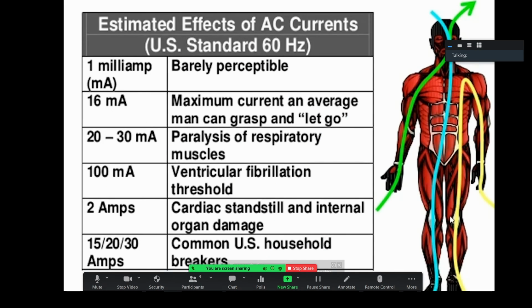But one thing that a lot of technicians say, it's kind of silly, is they'll say that it's not the voltage that kills you, it's the amperage. And while there is definitely truth to that, when we're talking about working on high voltage electrical systems that are connected all the way back to the main distribution panel, back to the transformer out at the street, you have nearly an unlimited source of amperage.